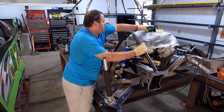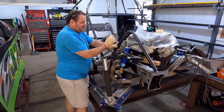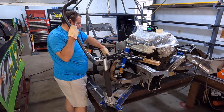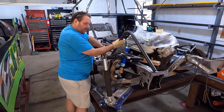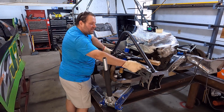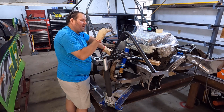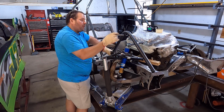Here's what we're going to do. I'm going to go ahead and leave this leg long, and I'm going to cut this angle for it to sit right on this corner of this flat right here. I'm going to get that angle pretty well cut. And then we'll turn around and start trimming back this end until she gets down to that height I'm looking for. And hopefully we get it to merge together with that 45 degrees on both legs.